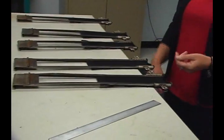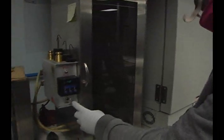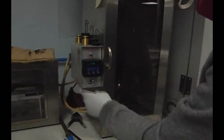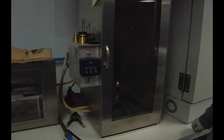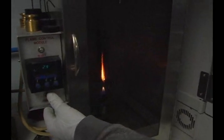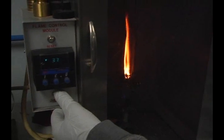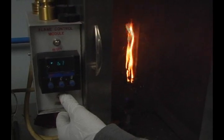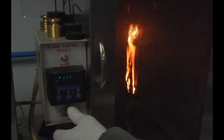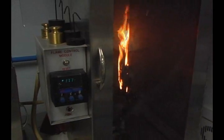Here we have set up some samples for the vertical flame test, where these will be put into our vertical flame test cabinet. A flame source will be put on the edge of the fabric, the flame load will be applied for a given duration and then shut off. We then time how long it takes for the flame resistant fabric to self-extinguish the flame. There are minimum requirements — they actually have to self-extinguish within two seconds. Everything that has an SFI rating — any driver's suit, shoe, glove, et cetera — uses materials that pass this test.